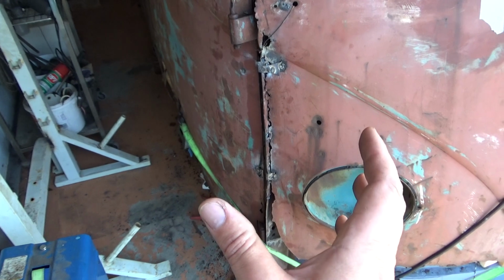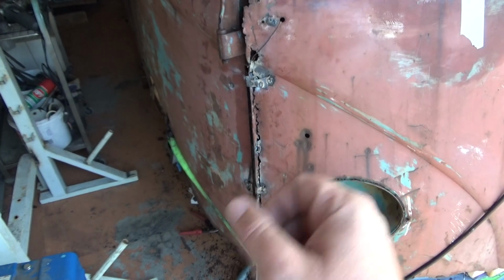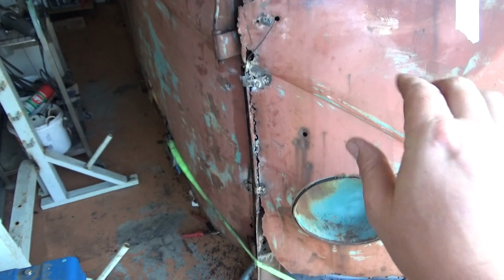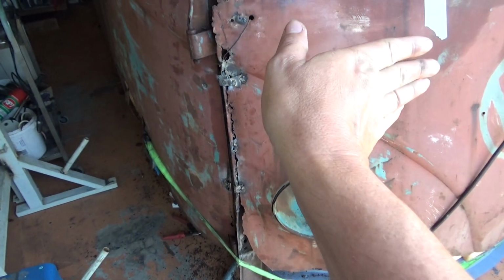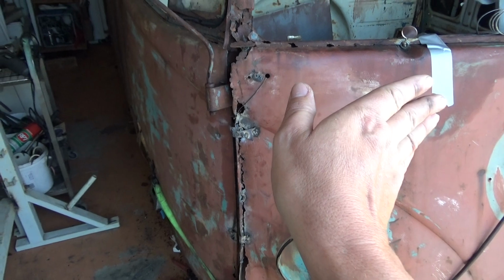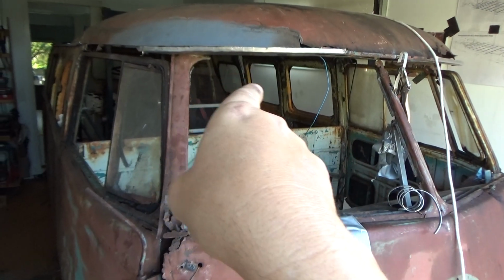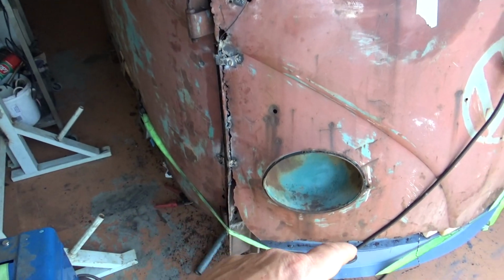But if you start doing that on an unlevel floor, even on a rotisserie, you've got certain flex, and then say for instance one corner drops down half a centimetre and then you weld something in level, when you go back onto a level floor it's actually going to be higher, and then the whole vehicle's off square. So I know it's difficult now and I really want to get into that back side there, but the important thing is to get the frame welded up solid.